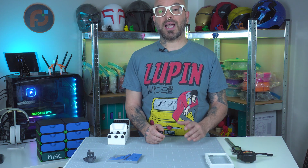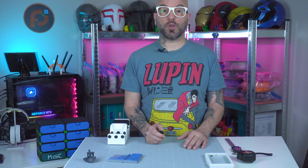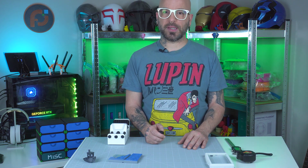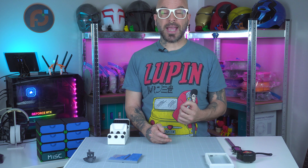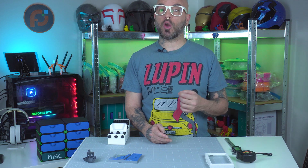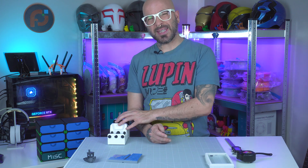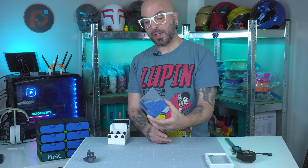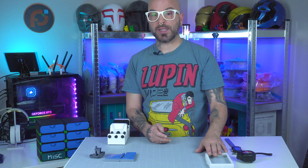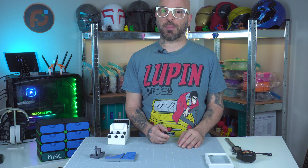If you want to try this yourself, I've linked the file project in the description below. If you have any ideas for stress testing 3D printed tools, drop a comment — maybe next time I'll try carbon fiber filament. This 3D printed vise built with ASA, ABS and TPU not only looks great but works incredibly well, except for the parts I showed before. It doesn't clamp fully, especially at the bottom, but for small plastic parts it's perfect. It's a testament to how mixing materials can optimize performance for specific applications.